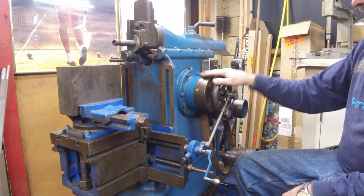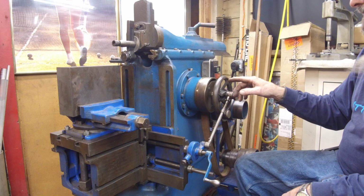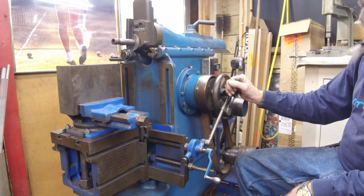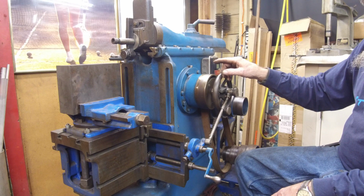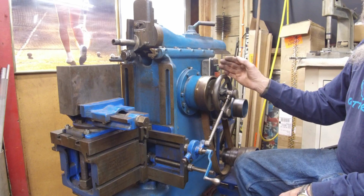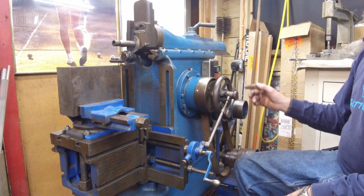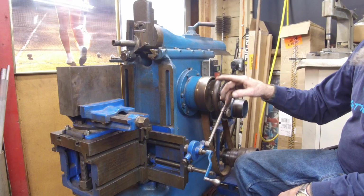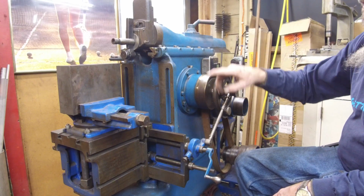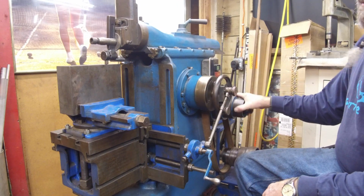All right, there's a rotary cam in here that is connected to this axis of this shaft right here, and a pinion gear runs on a ring gear, and as that ring gear goes around, then the eccentric of the pivot point moves out or in towards the center. When it does that, it has a forward stroke and an aft stroke, or a back stroke. That pin is working the top side of the pivot against the bottom side of the pivot, meaning it takes longer to go from 3 o'clock to 9 o'clock than it does to come back from 9 o'clock to 3 o'clock, because you're going to be running a longer stroke in the open area and a faster on the tighter area. So when you rotate this here, the ram goes as a power feeds out.